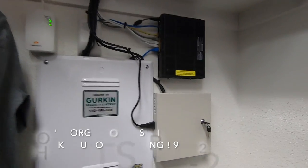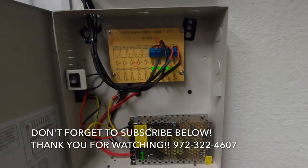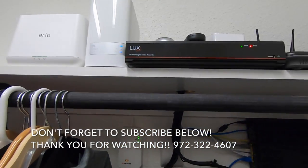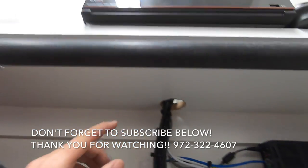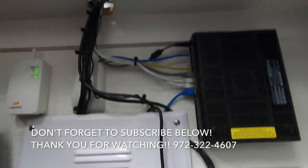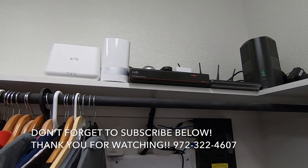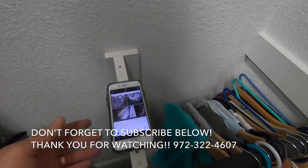All right, so here's our finished product. We have our power supply here with our lines ran in to each individual camera. And then our Lux Technologies DVR up here. And we actually drilled a hole in the cabinet because the customer just had the wires running across here. So we made it a little bit cleaner and tidy, and then hardwired everything. We also put in a Luxul router, a little bit better quality to give them better coverage throughout the home for all of their smart devices, because we did do a Lutron system here as well.